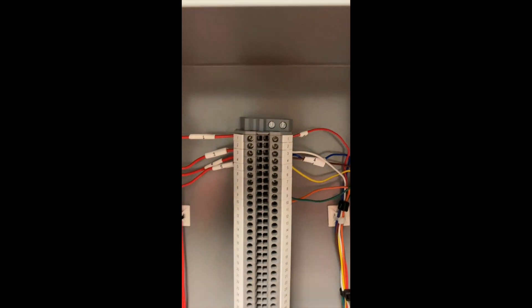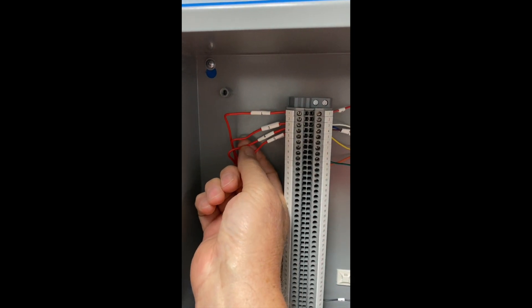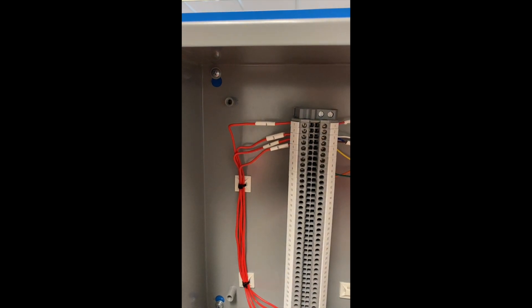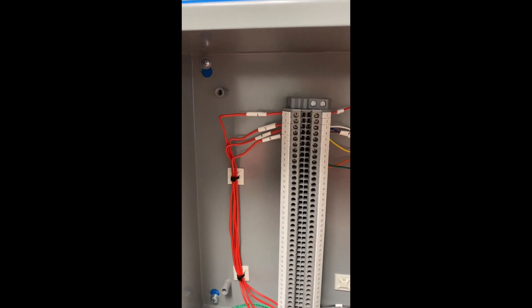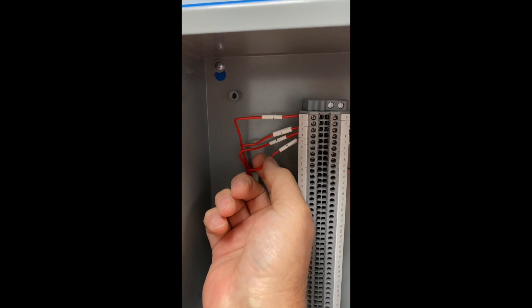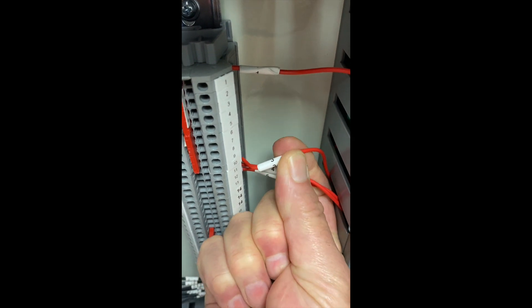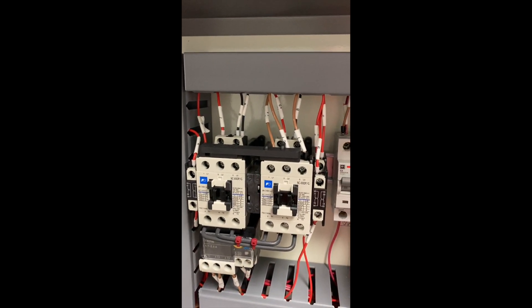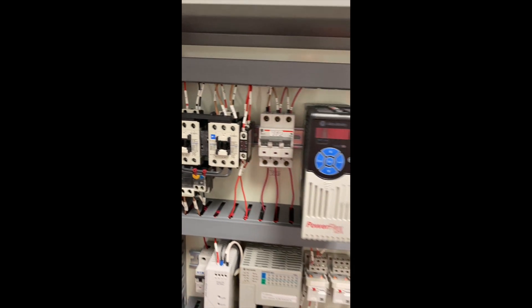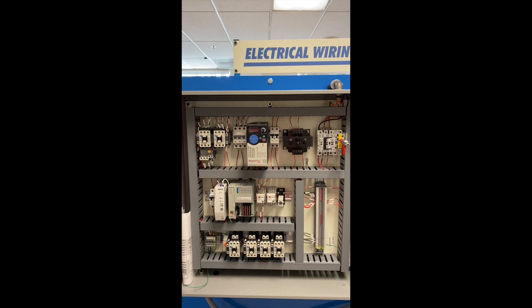I just wanted to end this video by showing you exactly what the application is. The students have labeled these wires — they're not the flag type, which is the first type I showed you. As you can imagine, if this terminal block was full of wires and it was all a bunch of flags, they'd be kind of flopping around in there. But they printed these and wrapped it around like I showed you on my second example — everything's labeled. If we come over here to this main panel, they've got wires labeled here too — they did the same thing I did. It's got the number 3 printed a couple times on there and wrapped around that wire. We've also got them up here on the forward and reverse contactors. That about sums it up — that's just a short tutorial on the labelers available here to you at the IET department that you are free to use on your projects.